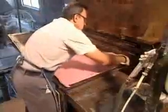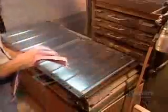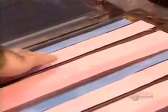They trim off the excess, then submerge the hot rubber squares in cold water to stop the curing process. To make erasers that erase both lead and ink, they cut beveled strips from 2 batches of rubber, one pink and one blue. The blue contains pumice, which gives it that extra abrasiveness to erase ink. They pair up each pink with a blue to form a 2-color strip.